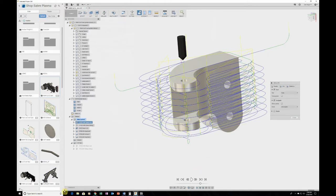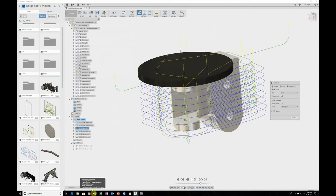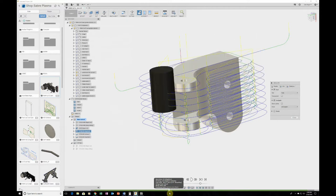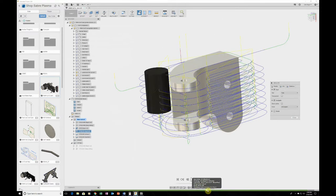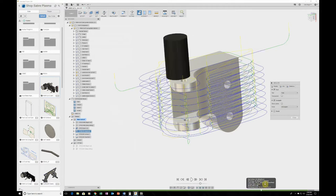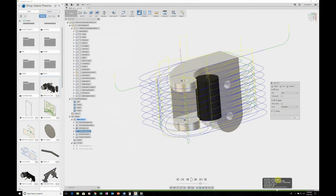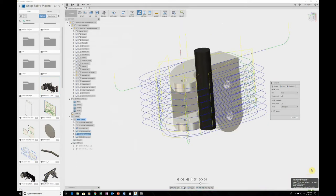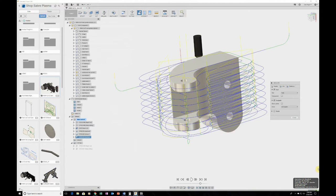This is going to be our start. We're doing a pre-drill. It comes off faces, and then this is the shear hog that's just going to remove the material. The whole way down, as you can see, it steps through. That's going to be the longest amount of time that the machine will be machining. And then we're going to go back in with the 2D contour with the 1/2 inch right here. And then we're going to do a chamfer.